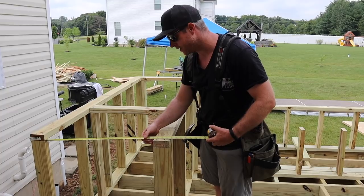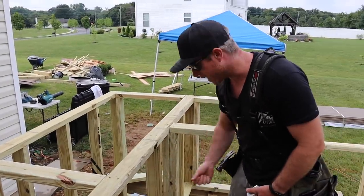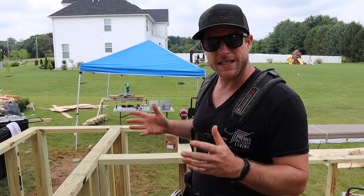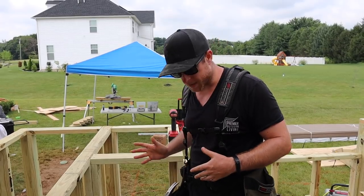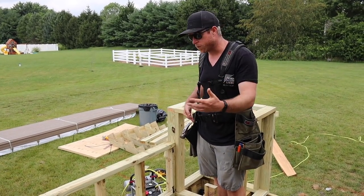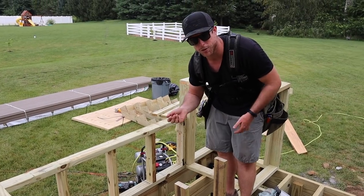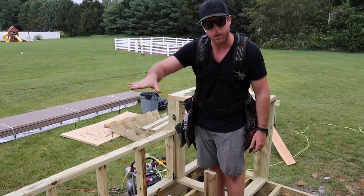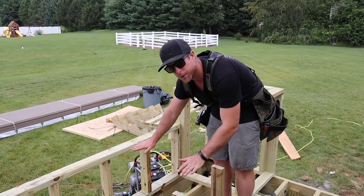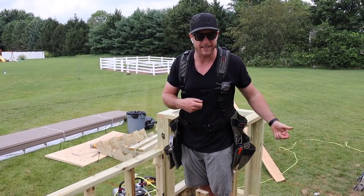It's 24 inches wide so we made it a tiny bit wider. Here's our wall for the back of our fridge, this starts our opening for the trash drawer. The really cool thing about this kitchen island is going to be the Traeger grill - everybody wants a Traeger grill, a nice wood pellet smoker. You can't exactly build that in because it needs ventilation, but we want it to look like it's part of the kitchen. It's 54 inches wide total, we want enough ventilation around that, so I made it an extra foot wide. The height right here is about the height of the stand, so we're not going to use the stand - just place the grill right on top. We'll have counter height prep area, a granite countertop sets down here at about 22 and a half inches, the grill goes right on top, with a small wall up the back. It's going to look built in and not just standing next to the kitchen.